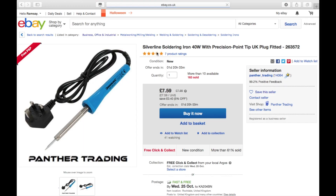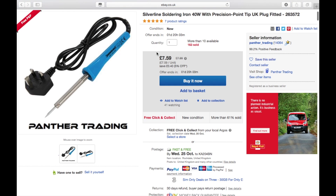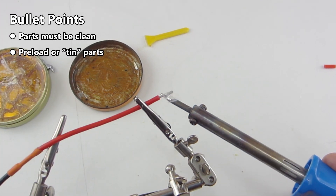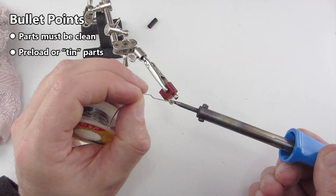Basic soldering and a Dean's connector thrown in for good measure. If this is something you've never done and you always have to ask other people to do these jobs for you, grab yourself some equipment and get stuck in — it's not difficult. None of it is expensive. You can get a basic soldering iron off eBay for under £8 delivered and you don't need a fancy one for basic jobs like this. Solder is only a couple of pounds; flux maybe a couple of pounds and a tin lasts for ages. Get yourself some scraps of wire, have a practice and you'll get the knack in no time. To summarise the bullet points: the wire or parts you're soldering have to be really clean. Even if you use flux, it's only really designed for etching the surface and removing surface oxidation — so if the parts are dirty or heavily corroded, it won't do a thing. If you're soldering heavier multi-strand wire, preload or tin it with solder first.